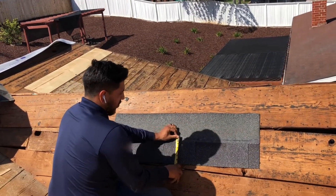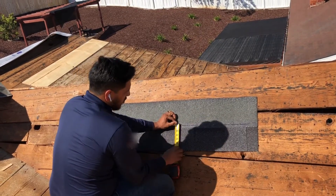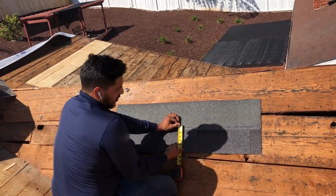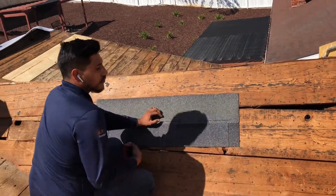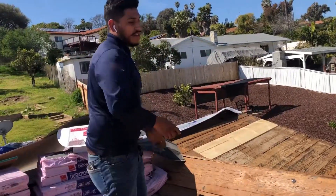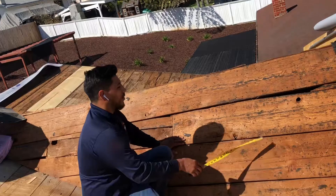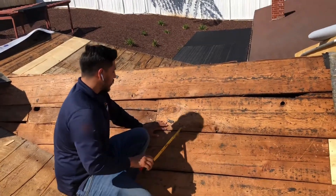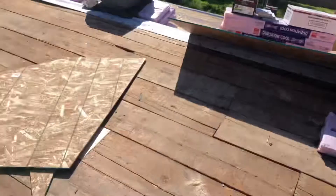The exposure line — you see you have probably about an inch of play. It's about six inches. This is a nominal one-by-twelve. What happens is when you're putting on shingles, it'll go into these seams, and we don't want that. So what we're doing here is we're putting OSB over the existing planks.